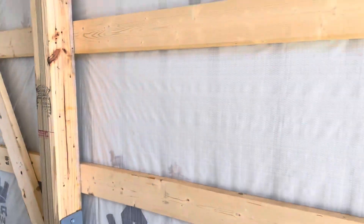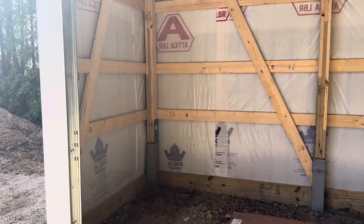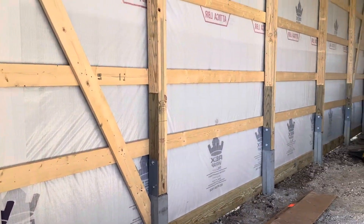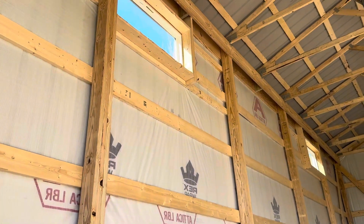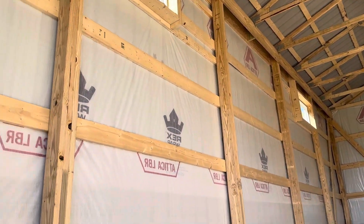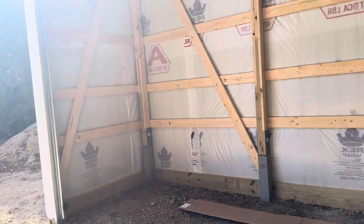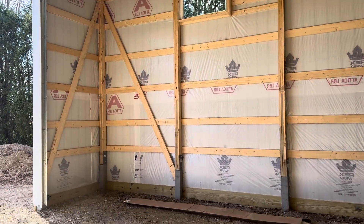You can see this wall bracing — two by six SPF 1650 MSR lumber. We ran it 30 inches apart. You can see how we boxed in those four by two windows up there. Now look at the diagonal bracing — we ran the diagonal bracing here and connected it right there.